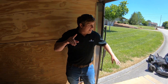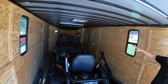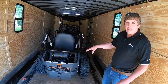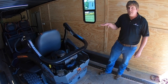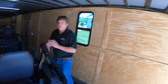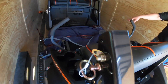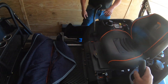I also want to show you one more mower — this is our top-of-the-line SRT XD. This right here is what we call the fleet machine: the RTHD series. You can get this in a Vanguard 26 horsepower, 32 horsepower, or the 37 EFI. You can also get it in a Kawasaki FX-850 27 horsepower. This one has Parker HTJ 12cc wheel motors — it's around an 11 mile-an-hour machine. The SRT XD is 13 miles an hour. You get front and rear radial tires, and a really nice seat made in Arkansas — basically a boat seat. The parking brake is on the floorboard, and deck height adjustment is the same: press with your foot and twist the dial.